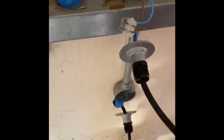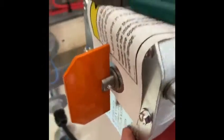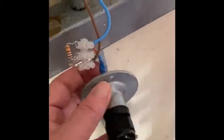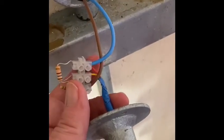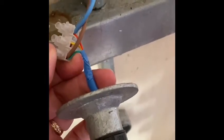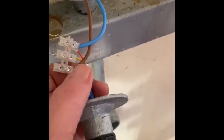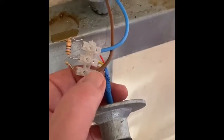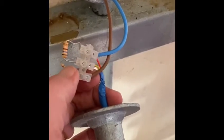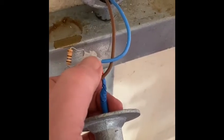This part of the video shows the connected version and the testing. I've got three wires coming out of my flow switch and flow switch isolation valve: a yellow wire which is my common, a red wire which is my normally closed, and a green wire which is my normally open. In normal condition, current is only going through to the end-of-line resistor, because that path is open and this side is closed, bypassing the firing resistor.